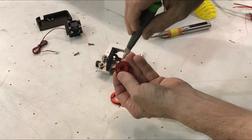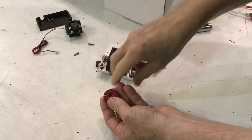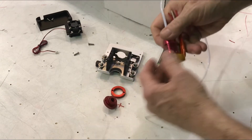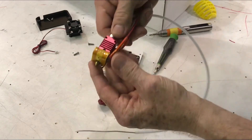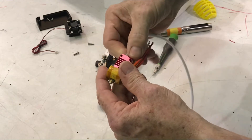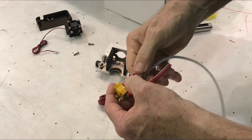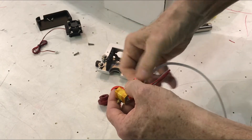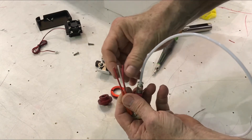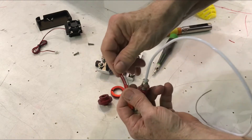There's a set screw in here and it takes the small Allen wrench that's also in your tool kit with your CR10. I did a cold removal of this. Normally when you remove the Bowden tube you want to heat everything up and extract it, but you don't have to do that with this — you can remove it cold. I snip my wires here. This is where the solderless connectors come in on these wires.